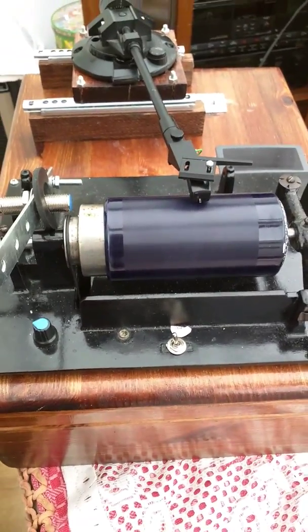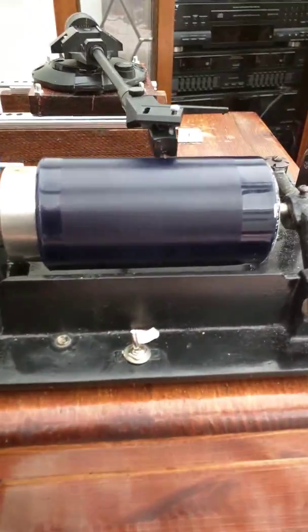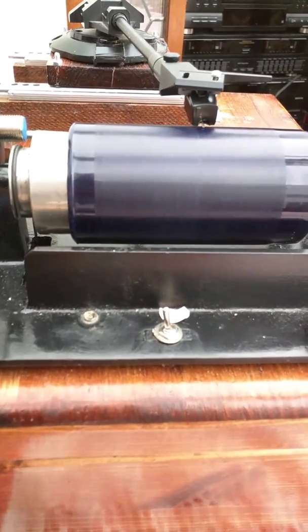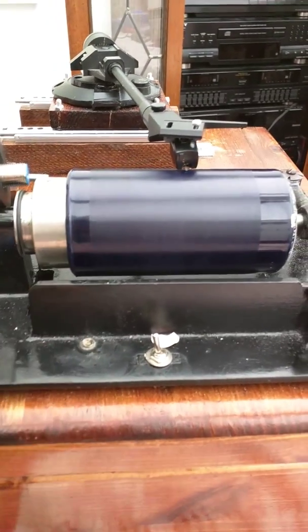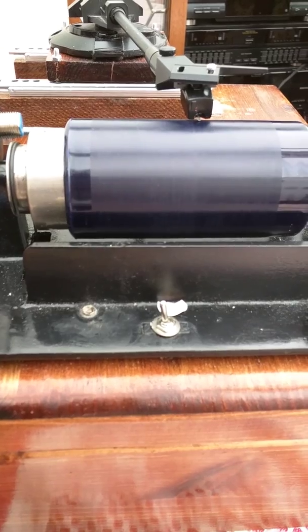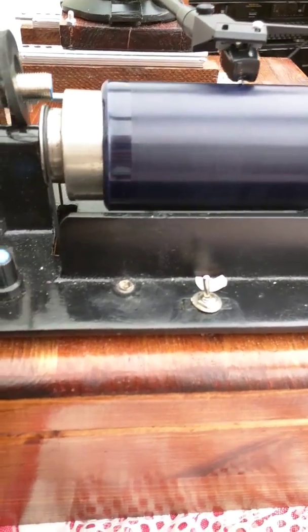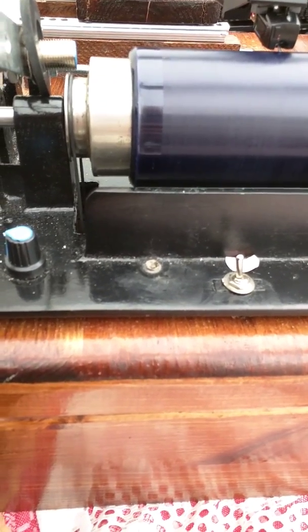Still a lot of adjustments to go, but it's very promising. What I'm going to do, because it's a stereo output, if we invert one of the channels, we can actually pick up the sound of the vertical modulation that's in the grooves, and that will reduce a lot of the surface noise. And when I plug the ground lead, it will eliminate that 50 hertz hum that you can hear in the background.